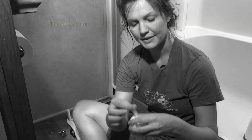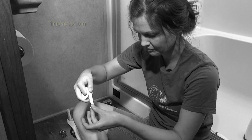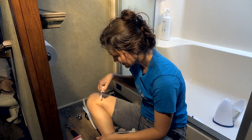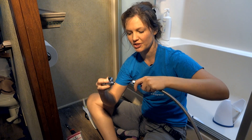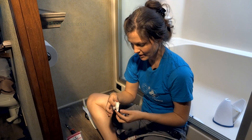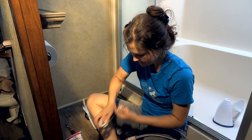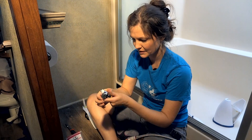This is plumber's tape. It is Teflon — it's very thin, when you touch it it feels like you're not touching anything, it's so thin. It's the same stuff they put on pans — it's toxic but they put it on pans that you cook in. Now, when you put connections together, if there is a little rubber ring in there, that's what's called a compression. So as this screws in, it pushes in the rubber, so you want this to screw in as much as possible. Some people say if you want this to screw in as much as possible, you don't want to put plumber's tape on. Well, I'm going to put a little bit on, just one round — I'm not going to put a bunch on. What the plumber's tape is good for is it basically just fills in a little bit of the gaps. It just went around the thing once — so it just gives it a little bit more filler. So then I can put these together.